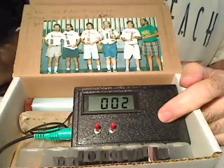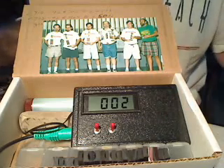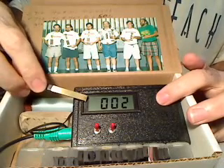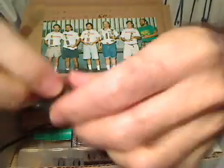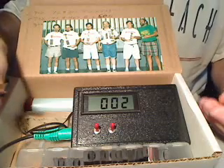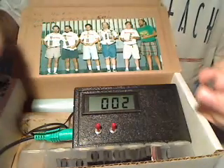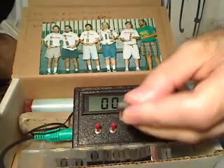I like it for the most part — it has some minor shortcomings, but for the price I think it's a good unit. Let's get started. We've got two switches here. Switch it on — it's not exactly at zero, it usually just reads one gauss, but I'd say that's close enough. This has a lower scale limit of 2,000 gauss, and you can measure up to 3,999 on the higher scale.